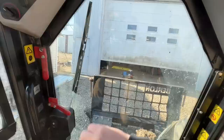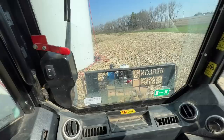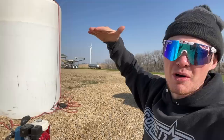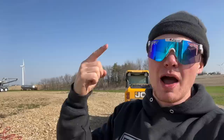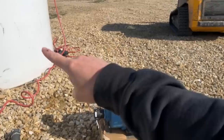Right now we need to get that pump over to the big water tank so we can start getting stuff filled up and start spraying. Our spare trailer has its flaws — when we tried pulling water out of the tank in the past, the pump was high off the ground and if the water level dropped below the pump there wasn't enough head pressure, causing an airlock. You'd spend forever trying to clear it. The idea with this little pump sitting on the ground is the water level can be way down here and it automatically feeds the pump — no airlock — and we can pump it right into the semi-trailer and be ready in 10 minutes.